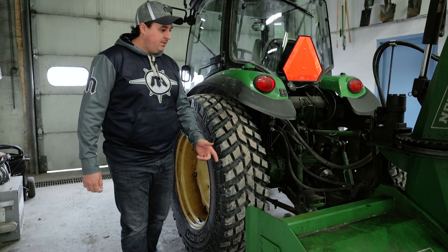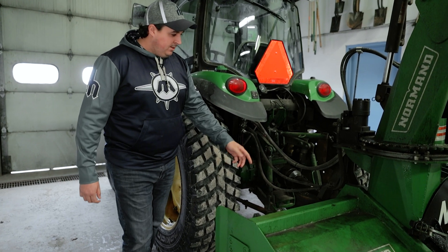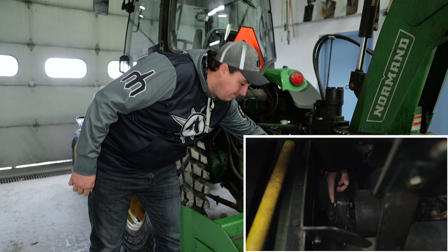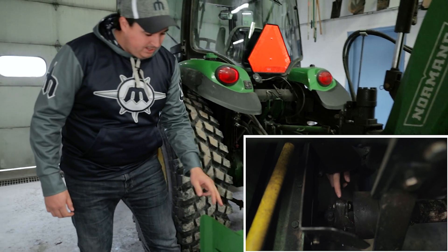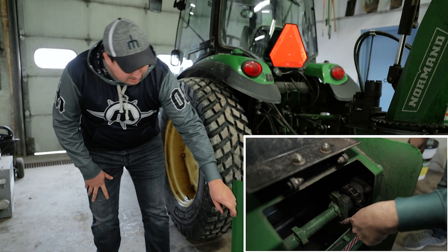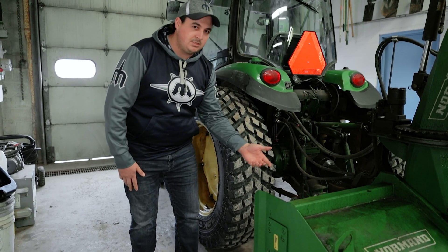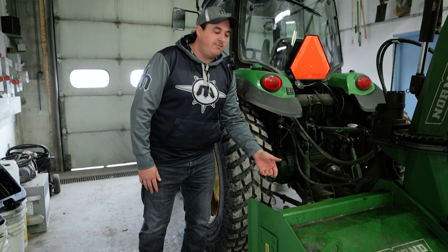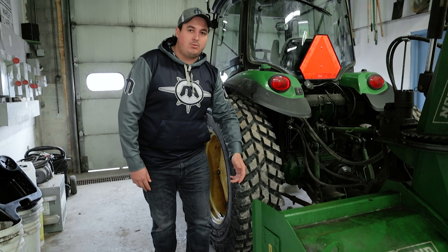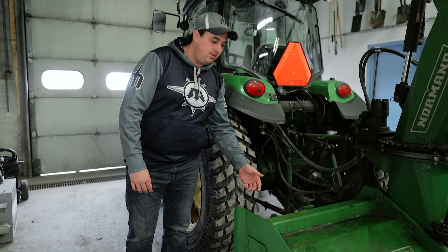Some likely things that are happening while you're on the road is maintenance here. There's a shear bolt right at your power takeoff, and then there are two shear bolts in this area here that power the chain and your auger to your blower. Sometimes if you get into some heavy snow, or just a bad bolt, they'll break and you'll have to stop the machine, get out, and switch them.